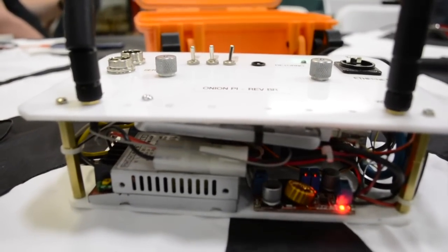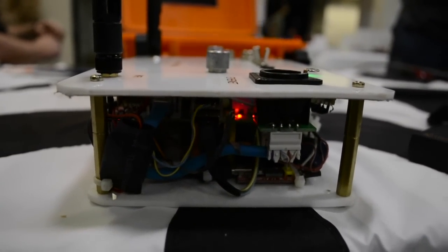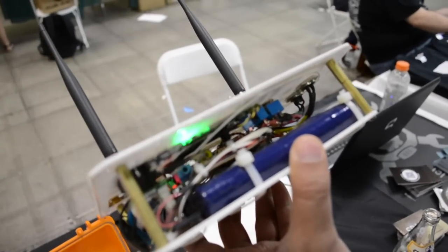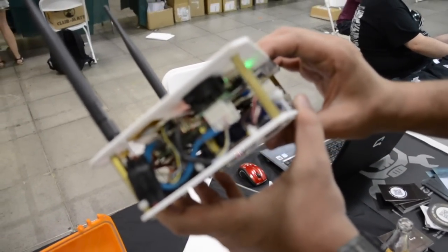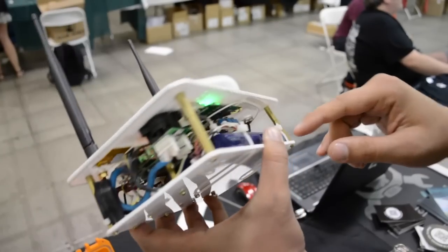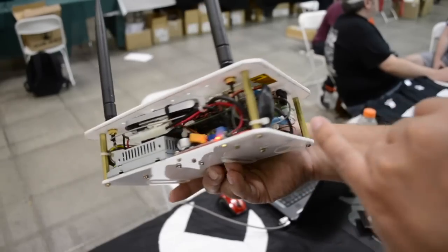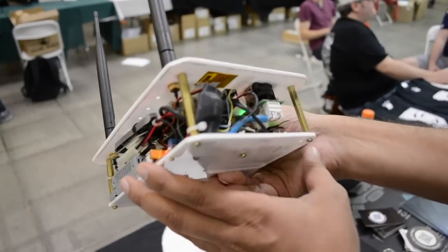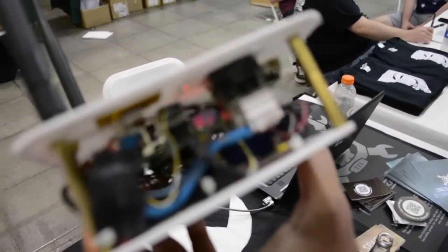We have here almost the same composition as the Onion Pi, with a Raspberry Pi in the middle of this setup. But we have some new things: a battery that can keep this thing running for about 26 hours. We do not use USB hubs — you can see the USB is connected just through the data cables. The power supply comes directly from the battery or from the power supply here, and we use a voltage regulator from radio-controlled airplanes. We also have the FTDI serial converter.